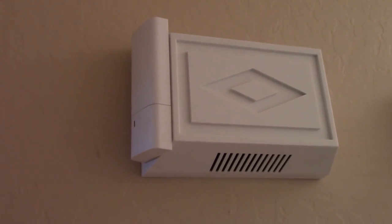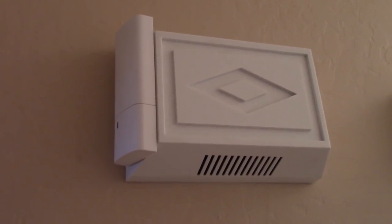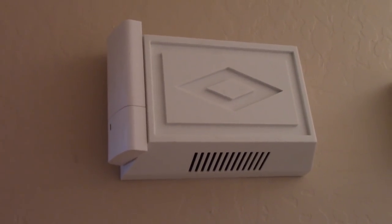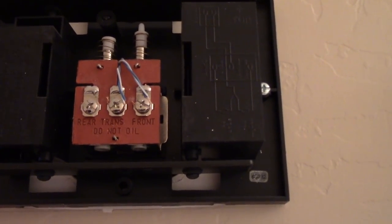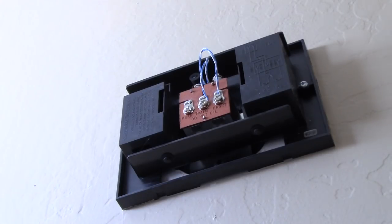Here's my actual chime unit — it's in the hallway. There's also a wireless doorbell extender on the side so we can hear the doorbell from the backyard. Opening up the cover, we have two wires on the transformer terminal and just one on the front button terminal, nothing on the rear. On closer inspection with better lighting, actually both terminals have two wires connected — they've used telephone wire as parallel feeders for a little better ampacity on the doorbell circuit.